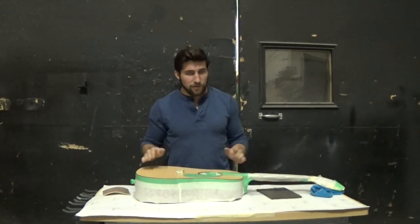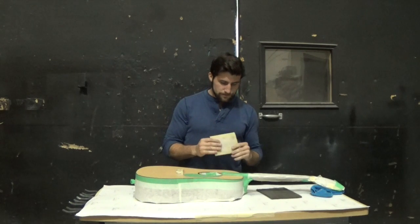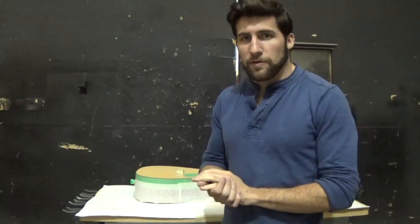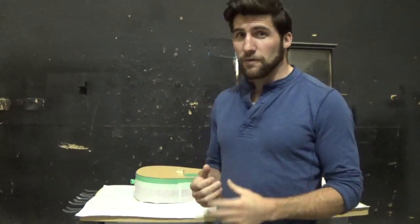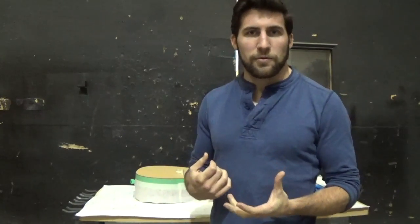What we're going to do is just give it a light sanding by hand with the grain using 800 grit paper. Don't go any smoother than that. For some reason people seem to get the idea that if they sand down to like 2000 grit, their final product is going to end up smoother — that's not the case with pretty much all paints that I use. The paint is more than enough to fill in 800 grit scratches, and the paint needs something to bite onto. If you sand down to 2000 grit before painting, there's nothing for the paint to grip and you risk losing adhesion.